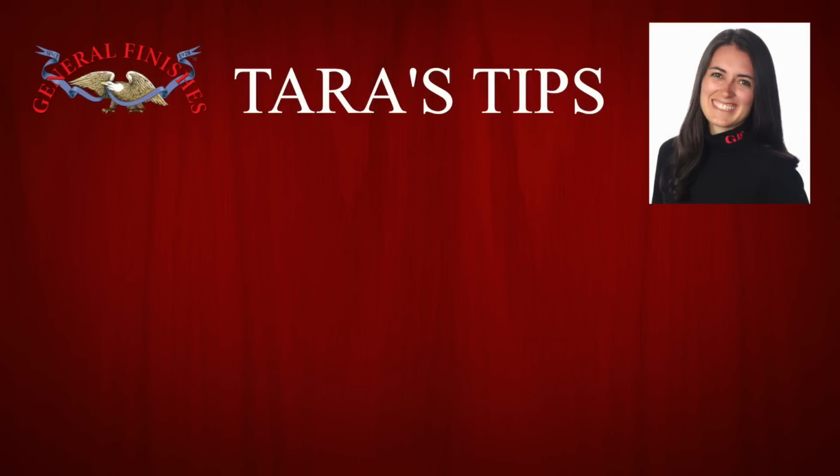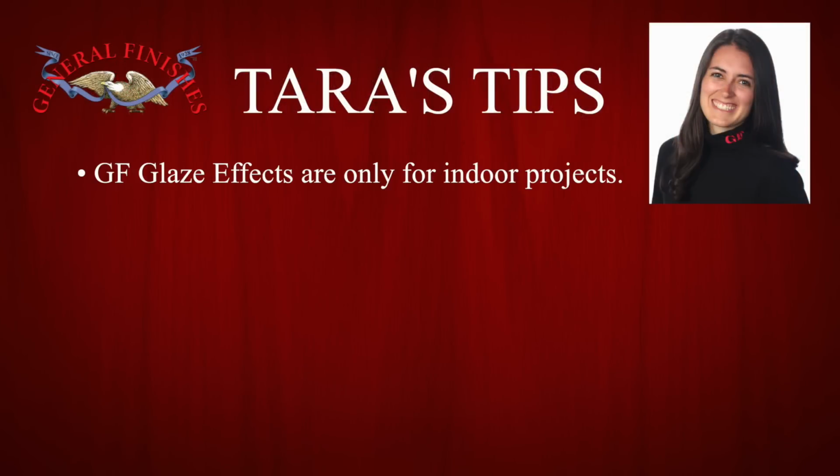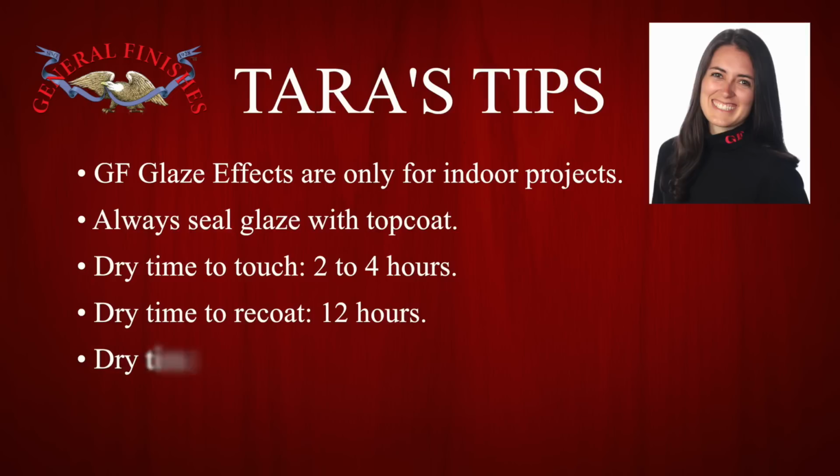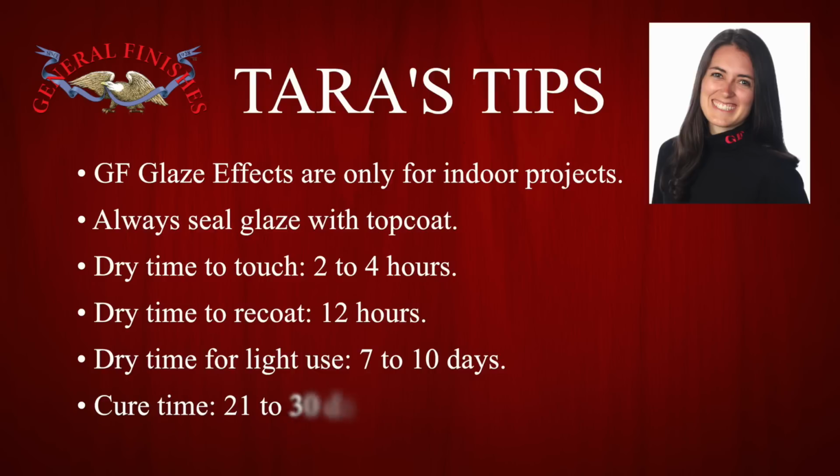Tara's Tips. General Finishes glaze effects are only for indoor projects. Always seal glaze with top coat. Dry time to touch, 2 to 4 hours. Dry time to recoat, 12 hours. Dry time for light use, 7 to 10 days. Cure time, 21 to 30 days. Our finishes are engineered to be compatible with each other. Test to your satisfaction when using with other brands.